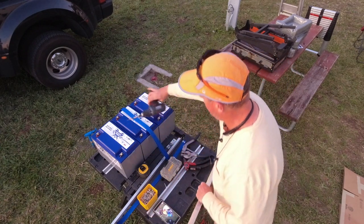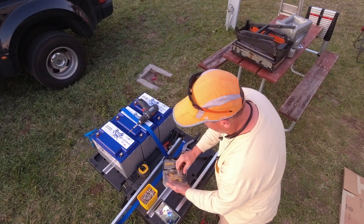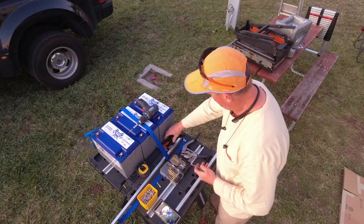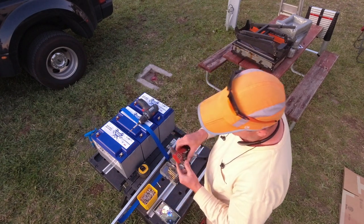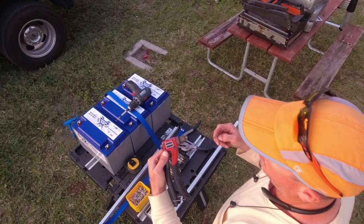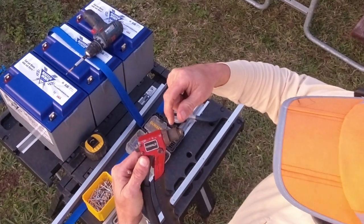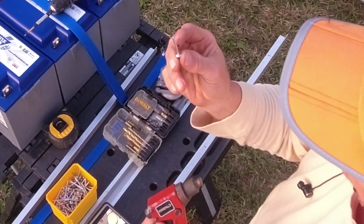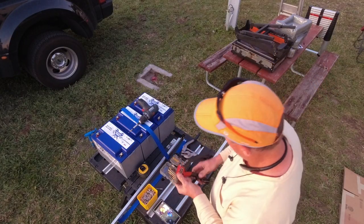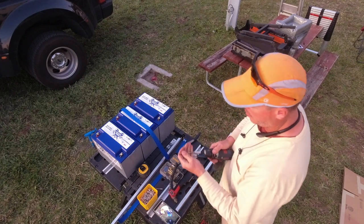Now that I have this ready, I use my 3/16 drill bit, which is the size for these specific rivets. I use Arrow, and this is a three-piece setup on the rivet gun so that I can fully adjust how much it pulls on the rivet shank. Shank might not be the right word, but that's the word I'm using today. So, pop my drill bit in here.